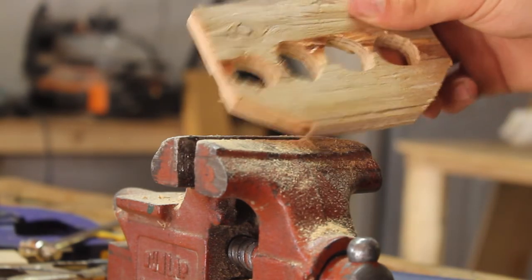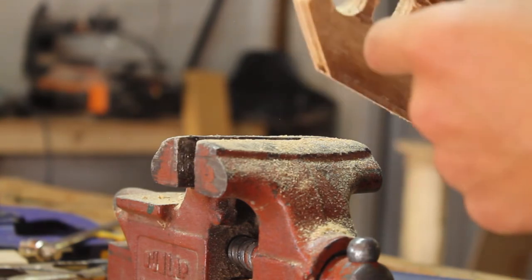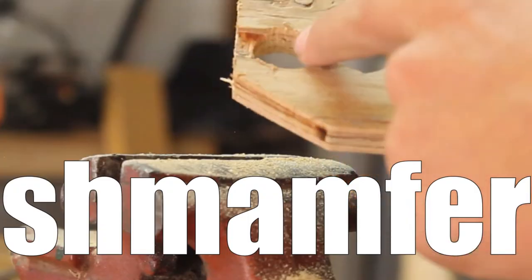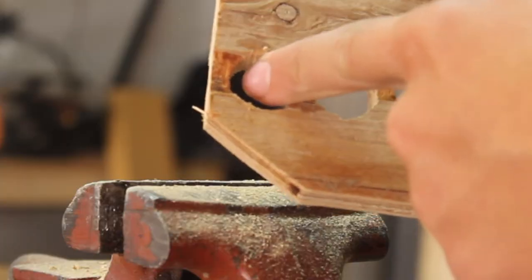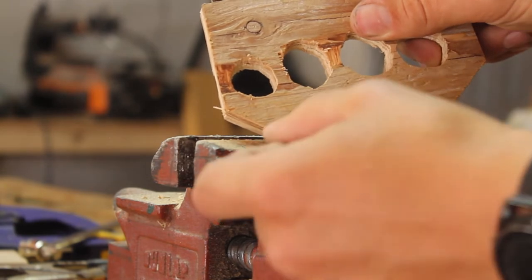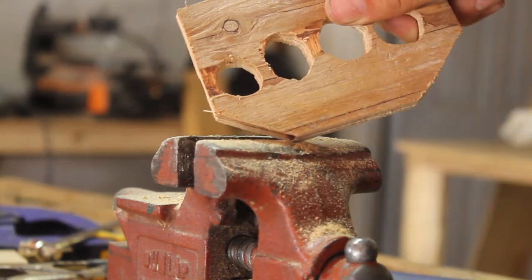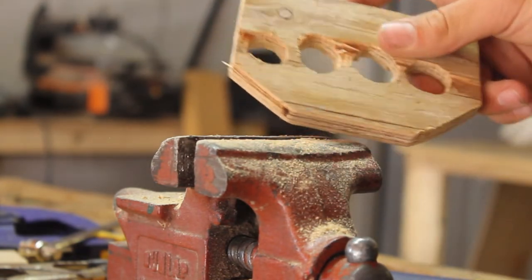Be careful if you're rasping plywood — there's almost a guarantee it's going to rip some of the plies off the back. You want to put a chamfer on the edge, which is basically a 45-degree angle on the edge before you rasp — on both sides — and that keeps it from ripping out material on the back or front. Do that every time you're rasping through there. For me, I'm going to do most of it with the coping saw.